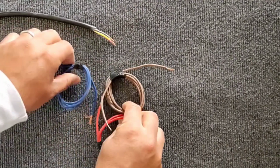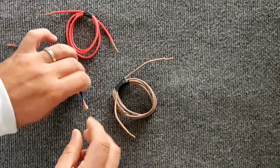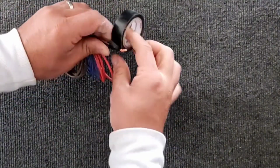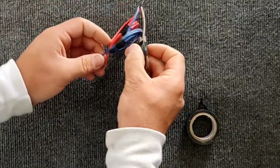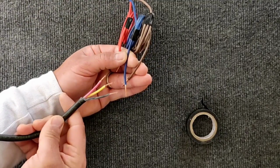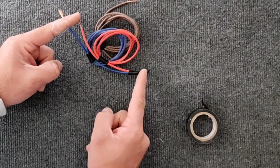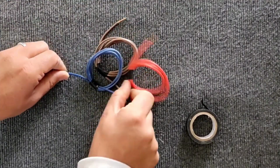If these 3 coils are inside the electric motor and the star connection is made, the coils are connected in this way. And now three-phase electricity is connected to these. In this case, there is a 0 point at the connection point, which means that this point has the role of neutral, and therefore the voltage between the 2 ends of the coil will be 220 volts.